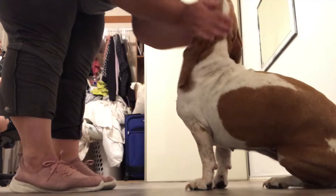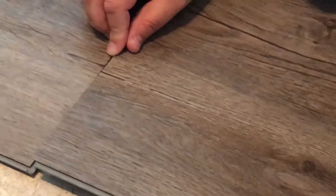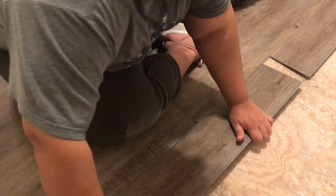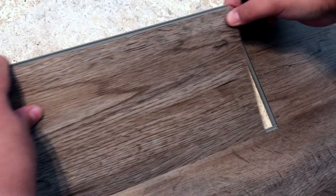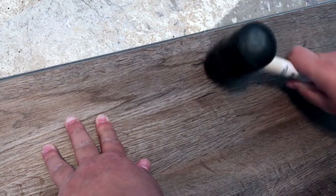I want to explain how the flooring works. Each plank has lips on two of the sides — one on the long side and one on the shorter side. The lips allow you to easily click each piece into the one you've already laid down, and then all you have to do is hammer it down on the end. It basically locks in when you hammer it down and makes it seamless.